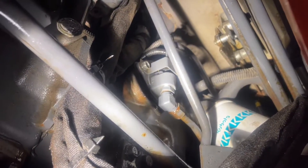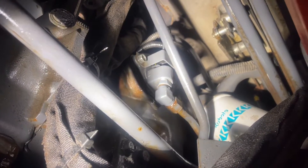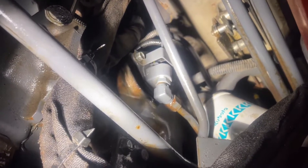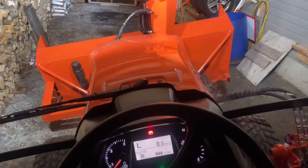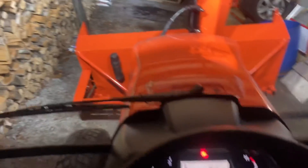It's just holding this on with an O-ring, so tighten that up. Then you're going to do your one-and-a-sixteenth banjo bolt — make sure you have your copper washer on each side. Give that a good snug on the washers. Now I need to fill it back up with the hydraulic fluid I drained into my clean pail. Having the tractor tilted up on these blocks made a huge difference in how much fluid came out — last time it drained about one and a half times the amount. This time it was probably only about 10 to 15 liters, so that helped significantly.